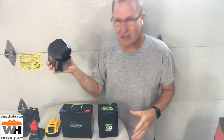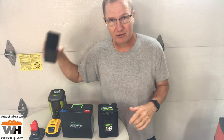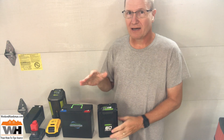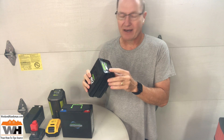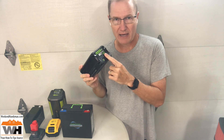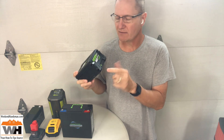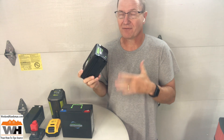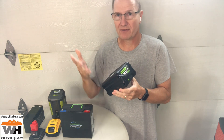Now typically this battery — this is the Ryobi — it can run that 300-watt inverter. Some have built-in batteries, and I've got a couple of other batteries here. The way we figure out available wattage is really kind of simple. Right here we've got a Greenworks Pro battery. It is a 60-volt, 2-amp hour battery. So literally what you're doing is taking your voltage — 60 volts — times your amp hours, which is 2. So this has roughly 120 watts of power available.